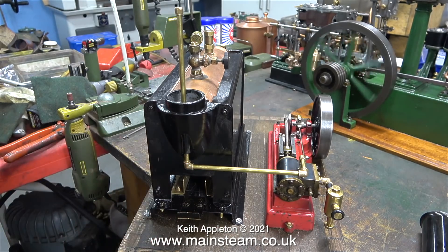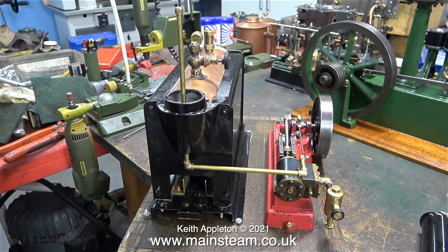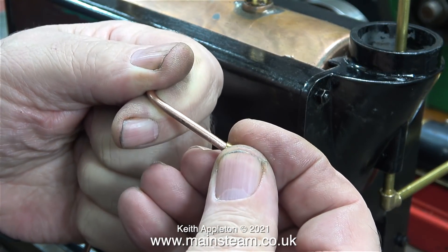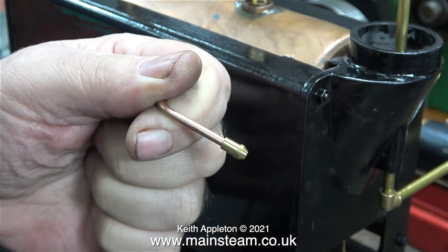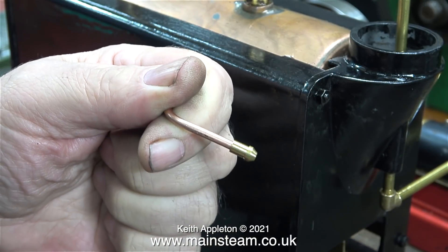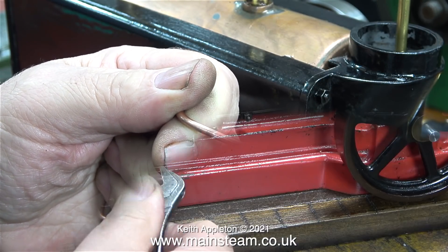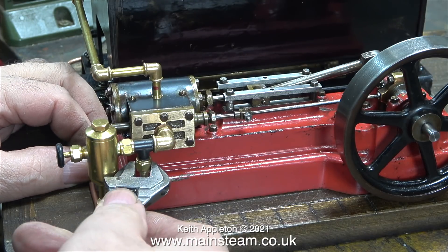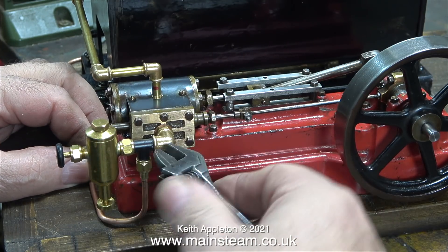This short series is about making the piping neat and before I started with any of the piping I sat down and thought about it. Here I'm fitting a coned union onto the end of the pipe, then I took it into the outer part of the workshop and silver soldered it to the pipe, and in this clip I'm fixing the pipe to the T piece on the inlet.